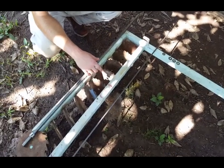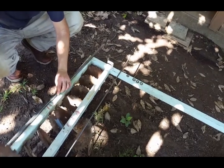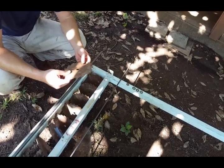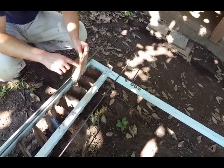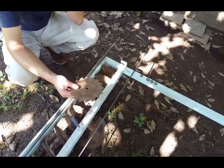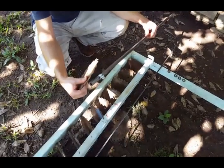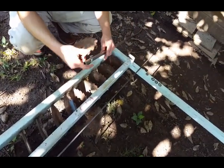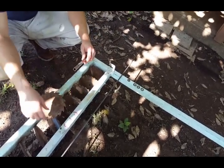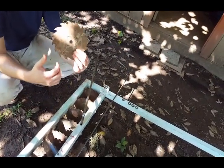So, I have to redesign it. I don't want to have to try to drill into these blades and make the hole larger. I don't have a drill press, and it would be really hard to do without a center point to keep the bit in line. So, I found that half-inch square tubing is truly half-inch across. So after some minor calculations, I found that corner to corner is about 0.7 of an inch. And this is 0.625, 5/8 of an inch.